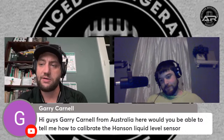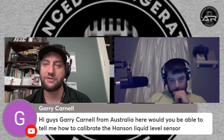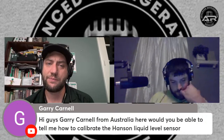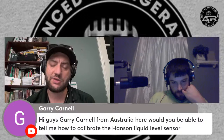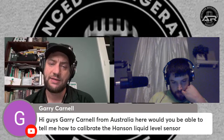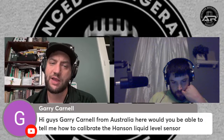Australia, how to calibrate a liquid level sensor. I'll let you take it. All right, empty out the receiver. Preferably do this in a colder time, so you can make sure that you can pump everything into the condenser. Force all your fans on to get the pressure as low as humanly possible. Make sure you valve off the receiver pressurization valve, otherwise it'll just keep filling up. Basically, want to get it down to absolutely nothing. You can assist this by putting discharge gas in the receiver, and that'll help boil off the refrigerant as well, to help push that refrigerant out.